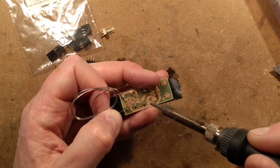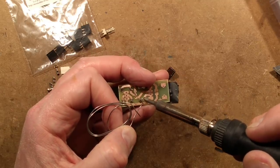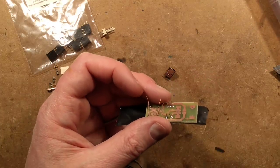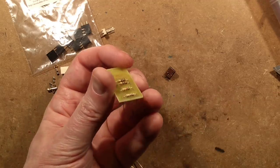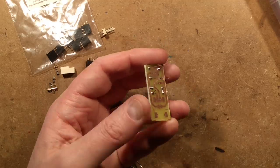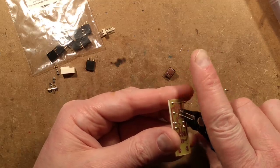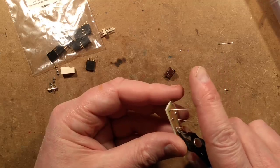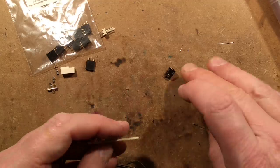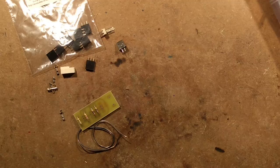That's me almost done with the resistors — this is a very simple circuit board with so few components. The last component I'm going to put in is the transistor, because the 2N7000 FETs are very delicate — they're quite easy to damage with static. This also suggests it might be a bad idea getting them off eBay if they come in plain plastic bags, as that's not a good way to ship static-sensitive components. Quite a lot of stuff comes pre-destroyed with static.